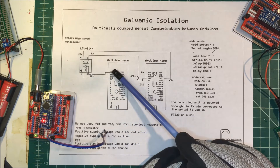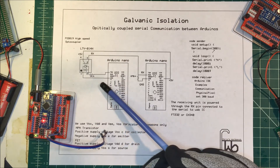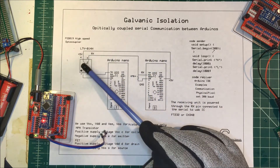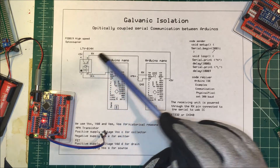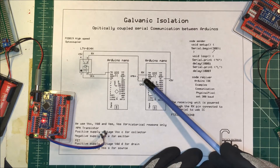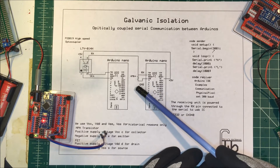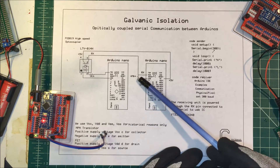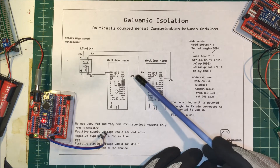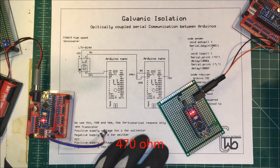What we're going to do is take our TX line, tie it to one side of the diodes through a 1k resistor, and the other side to ground. Then we take our 5 volts to pin 4 on the optocoupler, and off of pin 3 we come back to our RX. We need some resistance to ground to pull this line low. I found 1k is too much and 10k won't work either — 370 ohms seems to work fine. Let's hook that up and see if it works.